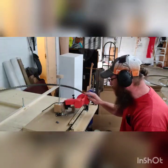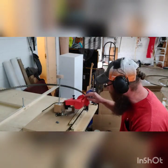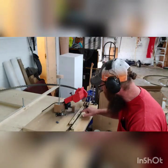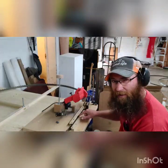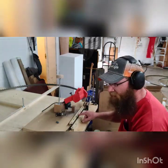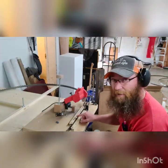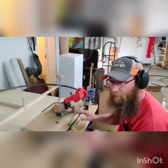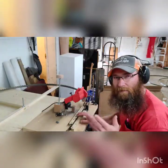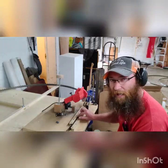Because this is on a spring, when I do that, I've tried it a few times, it tends to have a bounce as it goes up the tooth. And so I'm not sure if I really want to do that or not. Now I will say that doing that actually makes these teeth much, much sharper. But I'm not necessarily all that happy with the quality of the grind back there.